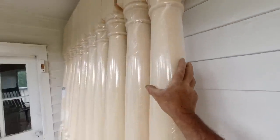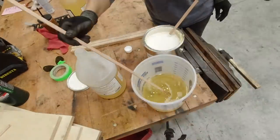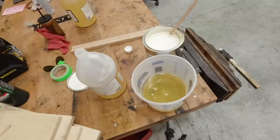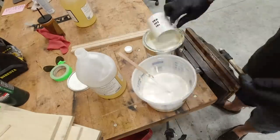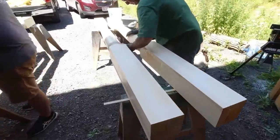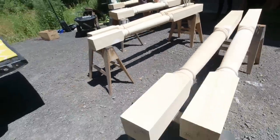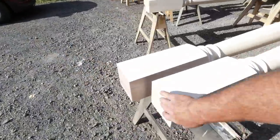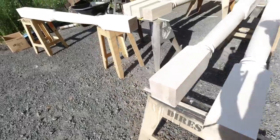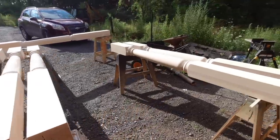Since we pre-paint them sitting and lying down, I was able to use the linseed oil — much easier to paint them that way. I did a little research and found that some people like to use about 70% linseed oil with 30% paint, and that's what we did here, as recommended by the linseed oil supplier. We whitewashed them a couple of times and then put a final coat of paint on. I made sure all the end grain was painted as well.